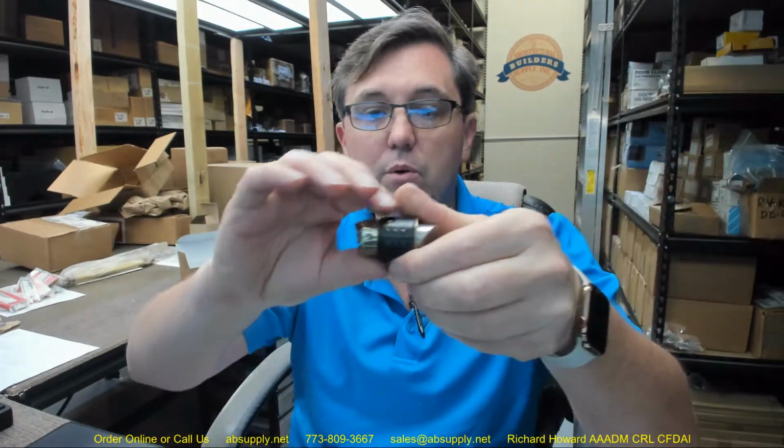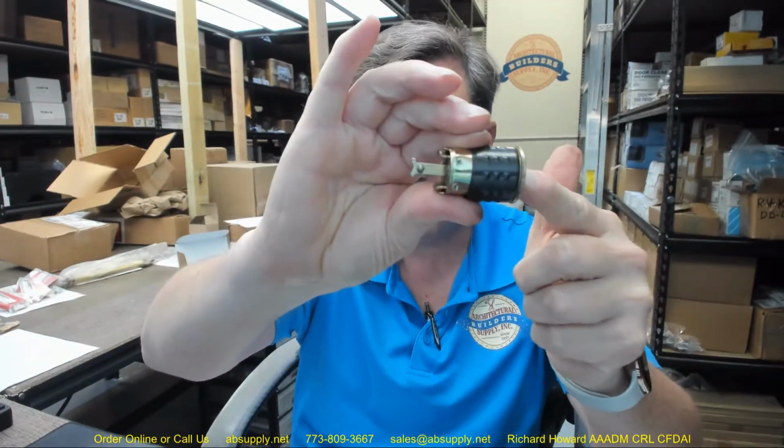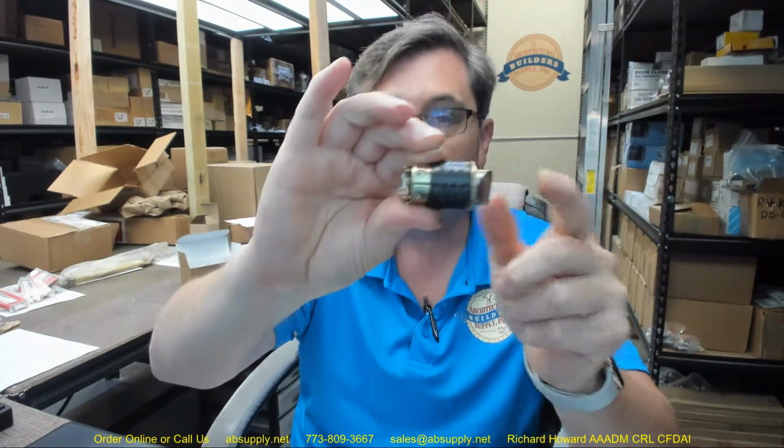I will tell you why. I had to think about that for a moment. I don't know this positively, but I'm guessing it's this. When the door closes, the latch bolt is going to hit the strike and it's going to force that back. This latch bolt construction on a passage is certainly, so these are for passage sets. Yeah, passage only. It'll work on a privacy, but the privacy won't work right.